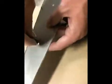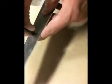So the only thing I've got left after filing the whole piece all the way around is I want to actually deburr these holes just a little bit. I don't want any, especially the top flange, or the top rib on the rudder. I'm probably going to put some rivets in these holes so that it's a pretty closed up enclosure.